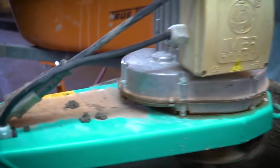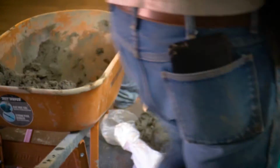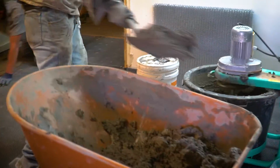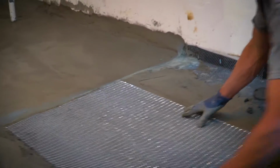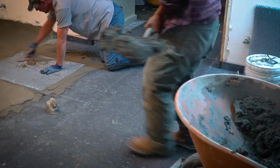So I'm doing something similar, but we're only doing 2 layers, except for extra layers on the big overlaps that we do. And doing it as a one coat system. So we put a section of plaster down on top of the lath that's like the roof or the floor or whatever shape that we're doing. And then we embed a layer on top of that and bury it, and then put a little cap layer over it.